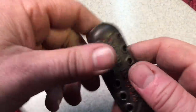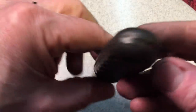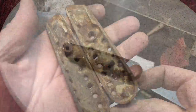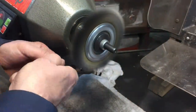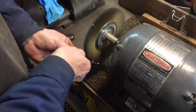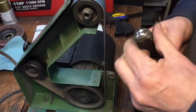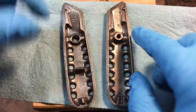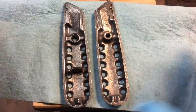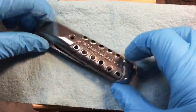Next up, we have this beautiful Defiance Stanley Utilitarian Cast Iron. You don't see many of these up in Canada. So I'm going to straighten this one up, clean it up, and let's see what we can do with it. Now we're just about finished with this. The only thing left to do is coat the inside here with shellac. This is raw cast iron, and cast iron will rust in a heartbeat. So we're going to coat this with shellac, then put it together, give it a good final waxing, and we'll see what it looks like when it's done.